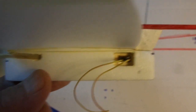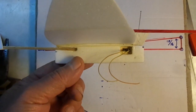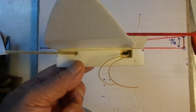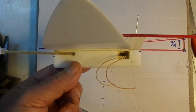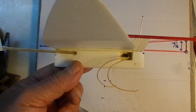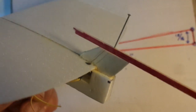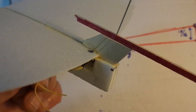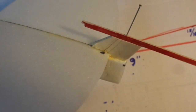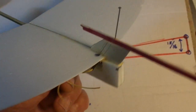Now, I'm going to line up our wing glue joint. If I line up that glue joint with the bottom line, you can see our top one is way off. We're pointing way downhill. So what we're going to do is sand that top edge and then keep comparing it to the diagram on the building board. That's going to be hard to do with the camera running. I guess we can try to do it. Let me set this back up on the tripod here.